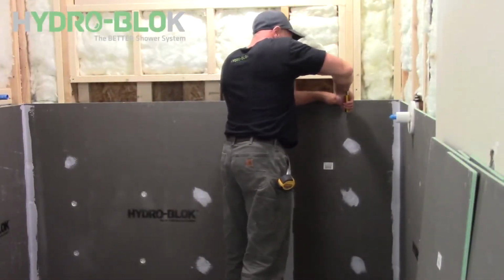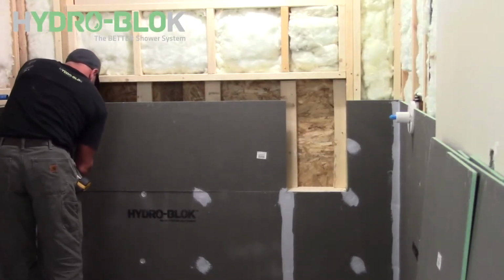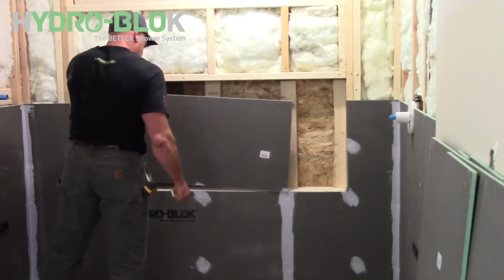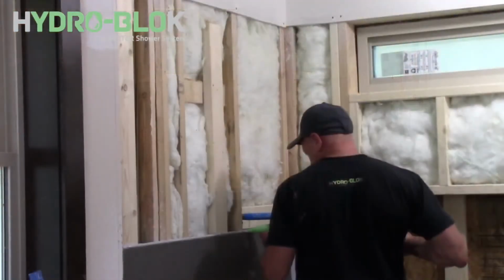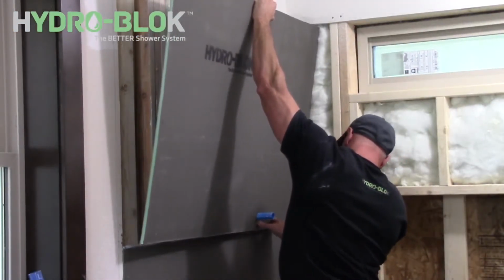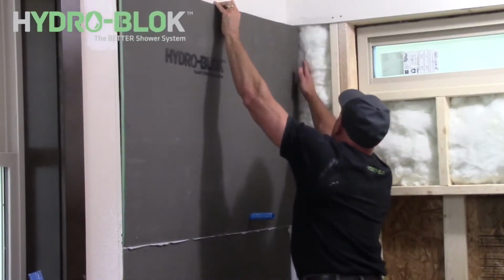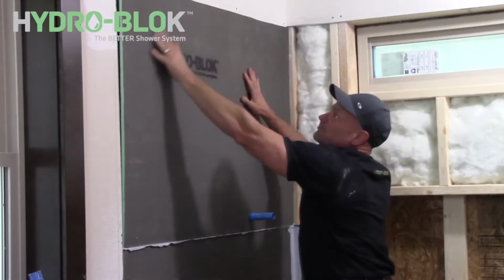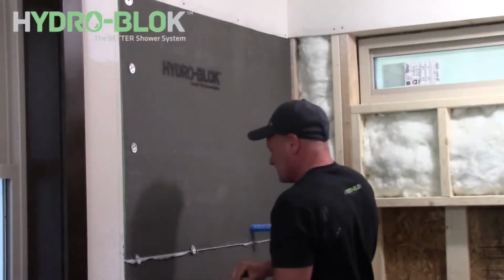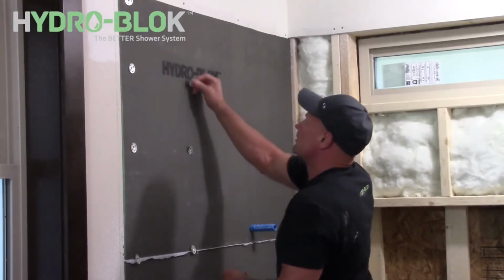Openings in the wallboard for niches and other custom features can be cut with a utility knife. Apply a 1/2 inch continuous bead of joint sealant along the foam edge of any horizontal wallboard seams. Install the new sheet of wallboard by angling it into the bead of joint sealant and pressing downwards firmly. Continue to secure the wallboard with screws and washers as it's placed.